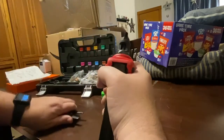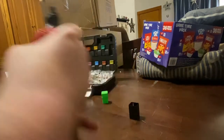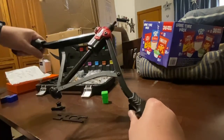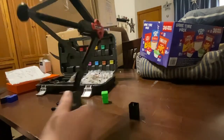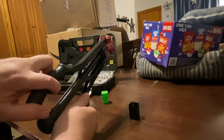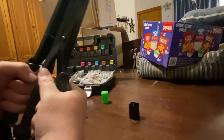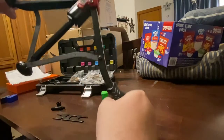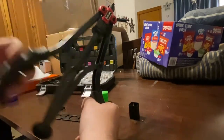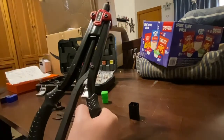That's it — you're ready to go, that quick and that easy. Installing the rivets is really easy too: open it all the way out, put it perpendicular against the surface, then close it up. It's a quality tool with great, comfortable handles, a very smooth and concise action, and it works right every time.